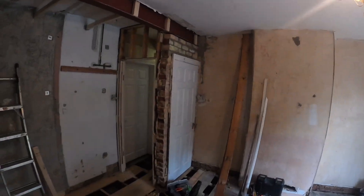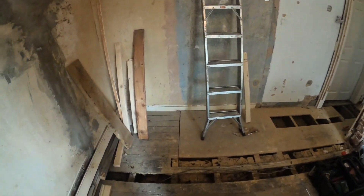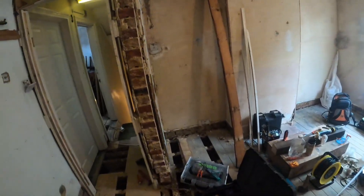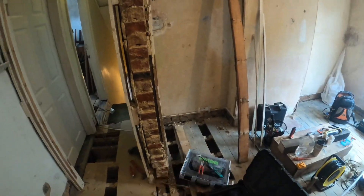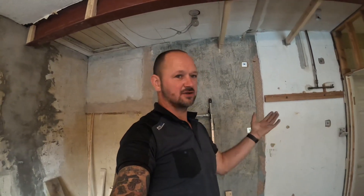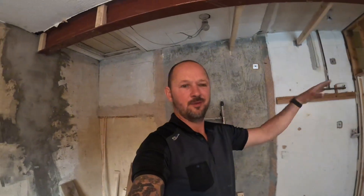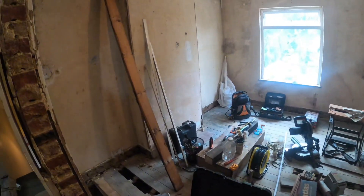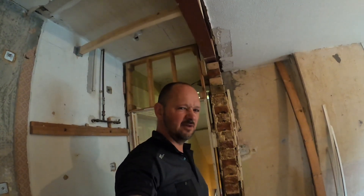We'll leave the lights on for a bit so we've got some light, but we're going to start pulling the cables into the positions where we want them — where we've marked on the wall with a double cross — to get the cables in and get some floorboards down, then do the chases. We've got rid of that socket over there and just joined the ring mains temporarily, because in an old house they don't just feed upstairs, they feed downstairs as well, so we've got to keep the downstairs going while we do it bit by bit. The radial is coming out there, which will go to a socket on the landing and then follow through to the bedroom sockets.